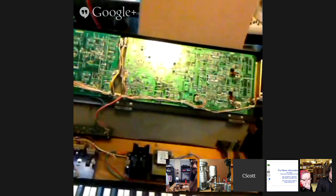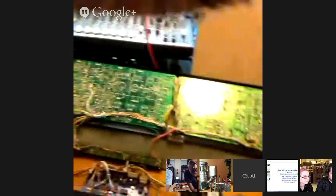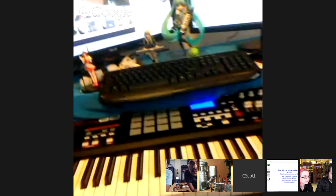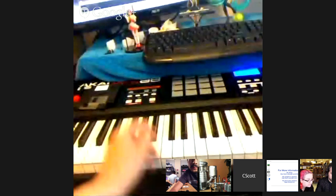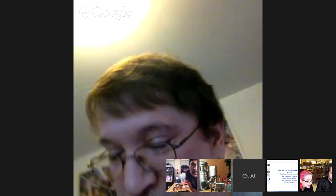It encodes the keyboard, and I said, well, we've got a serial port on there, so let's throw MIDI on there, and we have things like rollover and trilling. On a larger keyboard, you can't extend the range upward, so you just repeat the octaves. But you can extend it downward, because here's the bottom note, and you can go downward. Anyway, that is the key assigner replacement. It took me about a week to make.